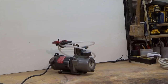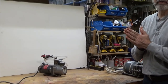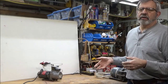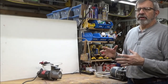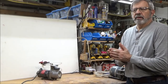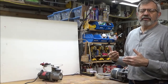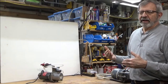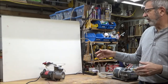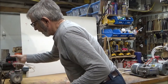If your wood is porous, a little punky, or you don't have a good seal, it's really important with a vacuum chucking system that you be able to move a high volume of air while maintaining that vacuum. Whether you get an additional inch of mercury — 25 versus 27 inches of mercury — probably isn't as important as making sure you get enough volume to maintain it. So that's the simplest option, but not really applicable for a vacuum chucking system.